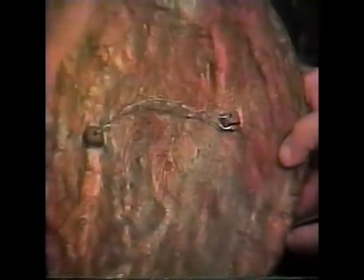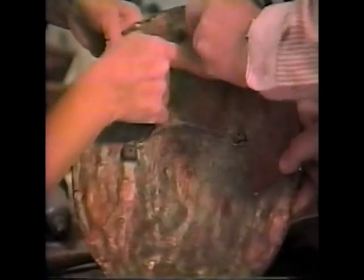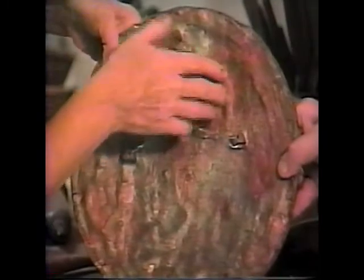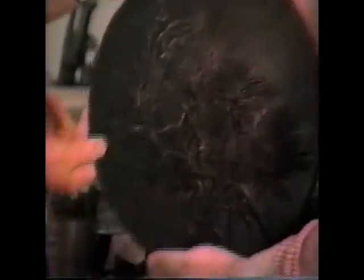You can see these little square marks — this is where the wax tubes were put, and of course they later became bronze, so you had a little square thing sticking out. You have to take it off. The foundry will cut them off but won't finish it. The other side has no marks at all — it was all on the back. But in something like this, I did have square pieces of bronze that had to be taken off and ground down.